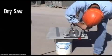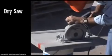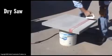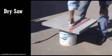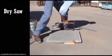If possible, cut pavers well away from the area receiving pavers to avoid discoloring with cut dust or slurry. Clean the cut paver thoroughly with a brush or blower to avoid discoloration. Score the back of the paver along the cut.